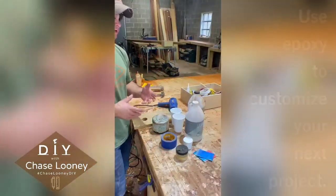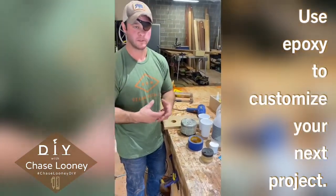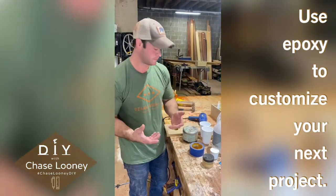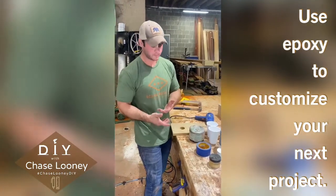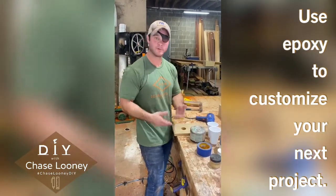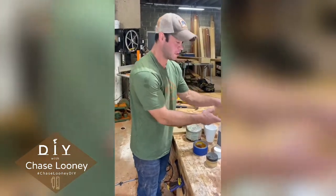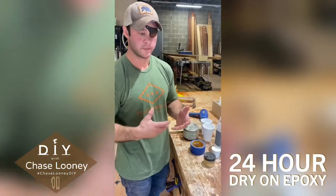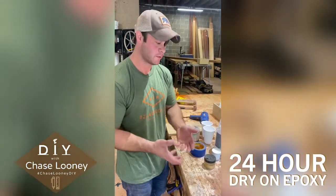So, what I use a lot on my projects is epoxy, whether it be to fill knot holes or you can actually do inlays with them. It's a fairly simple process. It's a love-hate relationship, as you'll find out as you keep playing with it. But you can get different mixes. I prefer a 24-hour drying epoxy because it's a slower cure time and it allows for the bubbles, which I'll show you, to come up real slow.